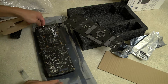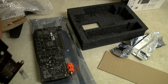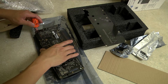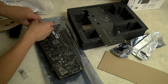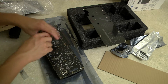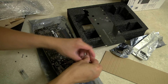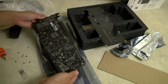First we're going to remove a bunch of screws — a total of eight screws. If you place the backplate on the back of the card to sort of map it out, you can see which screws you need to pull out. So let's pull them out using a small Phillips head screwdriver. All right, so we have all eight required screws out.